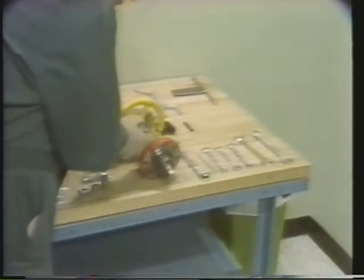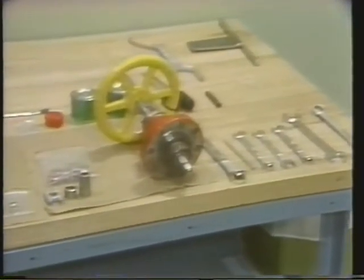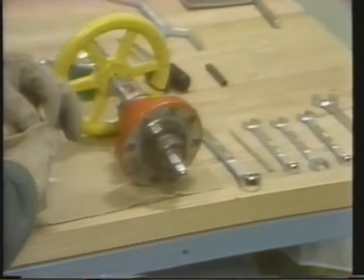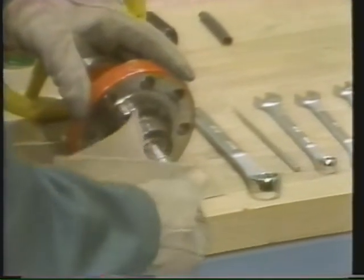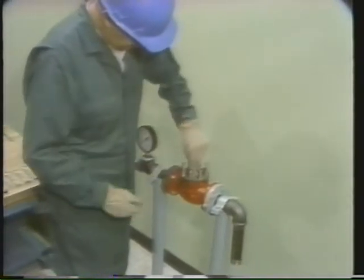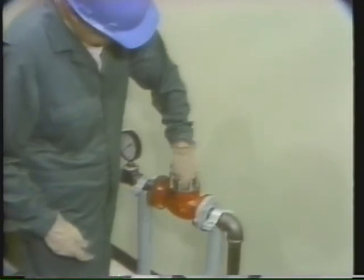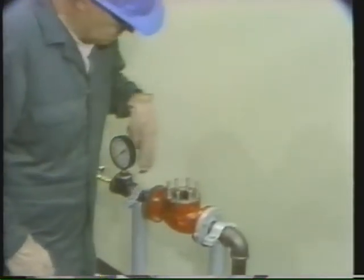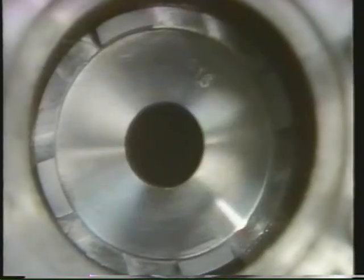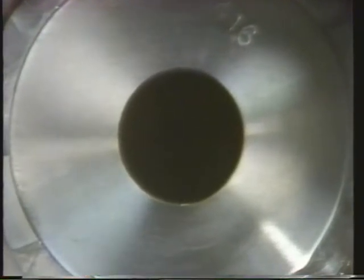The medium-grade compound is still on the plug. This compound contains bits of metal accumulated during the lapping. It is important to get all of the medium-grade lapping compound off the plug so the fine-grade compound can be applied to a clean surface. The seat area should also be thoroughly cleaned. Inspect the seat area to see that it looks clean — there should be a shiny, polished area all the way around the opening in the seat ring.